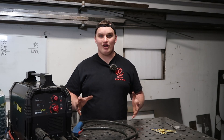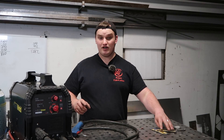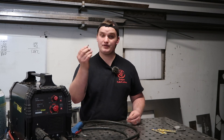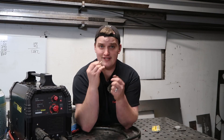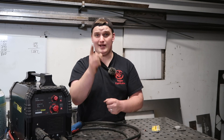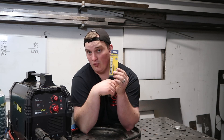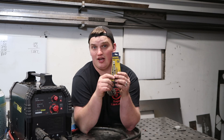We're going to go over our low dollar setup first. The only things you're going to need are a fresh contact tip — you should have had a spare one that came with the machine, or you should have purchased some because it's good to have on hand. The other thing you'll need is a number 20, 3/32" TIG torch collet and some tungsten. You're also going to need two drill bits — one 9/64" and one 3/32" — and a drill.